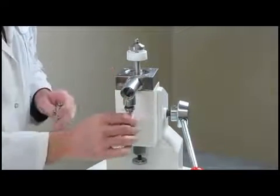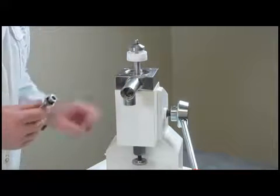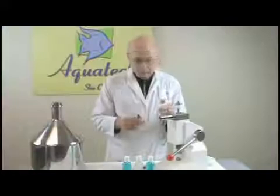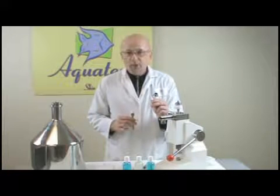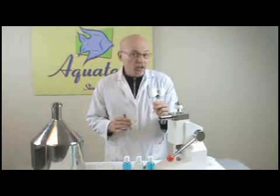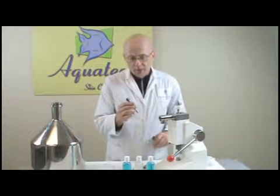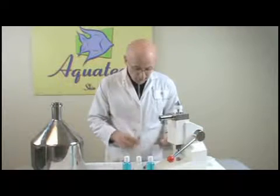Make sure that the actual nozzle is clean of any residue or anything left over. The machine itself comes with an extra nozzle for thinner viscosity products. Now, this will not do water-type products. It will do things like oils, salad dressings if you're in another industry. This will do lotions and shower gels, but it will not do things like ointments or anything thick like peanut butter.